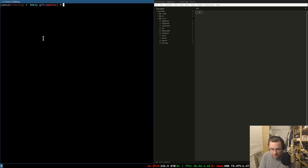So today, or I guess last time, I was working with Arturo 182's BlackBerry 10 Keyboard PMOD. It's a little BlackBerry keyboard on a breakout with a little ATSAMD chip on the back that handles all of the keyboard logic. I've got it wired up over I2C to a Nordic NRF52, and I was able to get some basic Hello World type stuff going.